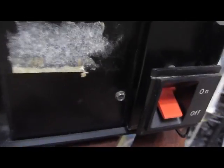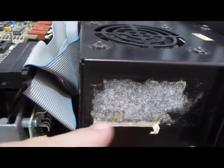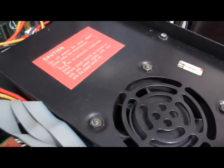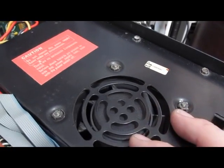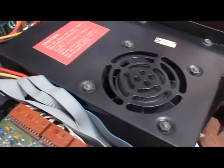I like the power switch on this thing. You can see a little bit of — probably a little rust or something going on underneath the paint here, it's starting to bubble. But it's actually held up pretty good over the years. I've gone ahead and turned this thing on with the power supply disconnected, verified all the voltages. Everything looked fine with the scope, no real excessive noise. Kind of crazy for the age of this thing that the supply would be okay, but I think we're okay to go ahead and power this up.